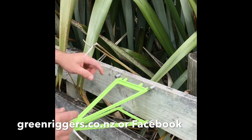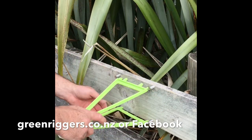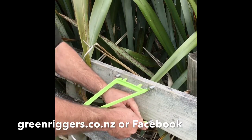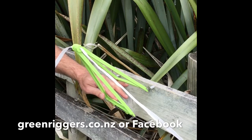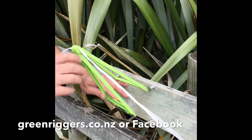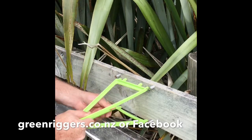There is another style where you could put these further back on top of the rails, and bring it up slightly on more of an angle. With horses that like to crib or bite their rails, it's actually quite a handy thing, because your hot wire is sitting up a lot higher and protecting your rails. So there you go — just pop that back on there.